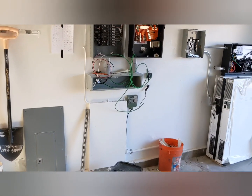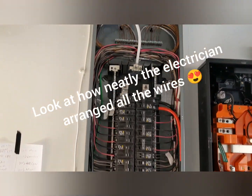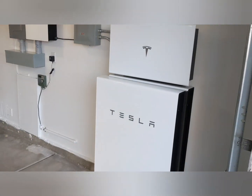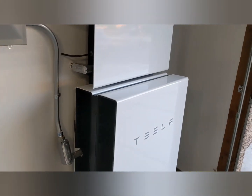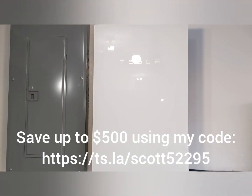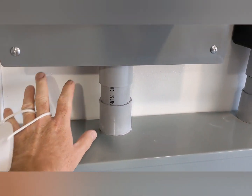The new breaker box is down in the wall, up on the left there. Now everything has been hooked up and the final installation has been done. We have our second Powerwall, which has been attached to the first one with some kind of mount, so it takes up less room. That's the inverter on top. The backup gateway is the box in white — that's the thing that switches between grid and battery. The new load center is here. That box is just passing cables through. Our old load center, the breaker box, is on the other side of the wall.